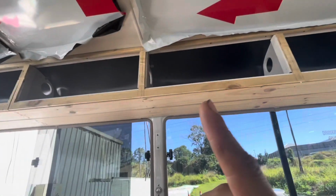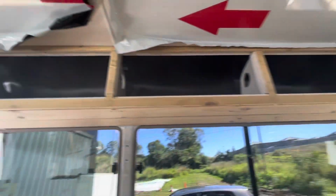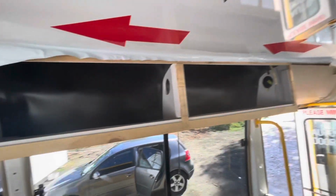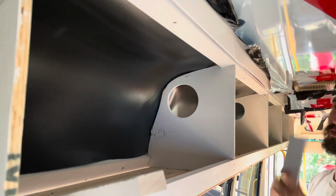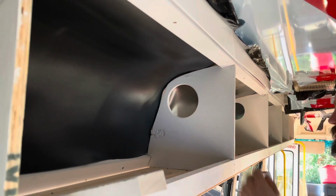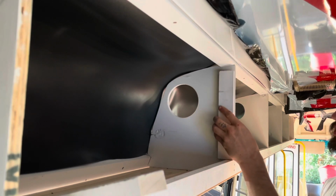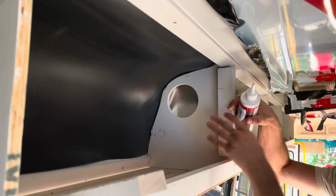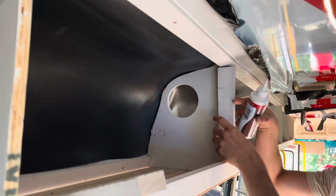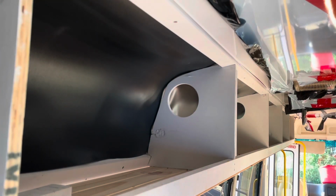And I think I'll stain the bottom with a dark stain, and those top parts are going to be painted white. So then we'll just go up and give everything a sand, get rid of all these markings. Putting on the extra pieces here and here, because when my door faces close, then they'll have something to close against. I could have done that sooner, but they're just going to go there. And you won't really see those at all once the cover front is in place. It's the only way to put all the faces on without drilling a million holes.